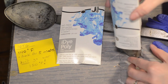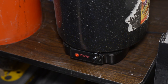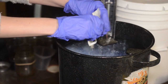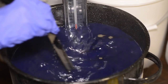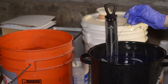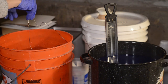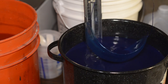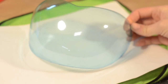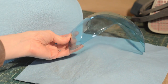You can dye PETG plastic with polyester fabric dyes — we have a more detailed video on this process linked below. A large pot of water is heated to 140 degrees, and I mixed in two packs of iDye Poly Turquoise. The visor is attached to a wire hanger and dunked into the pot for five minutes, then washed off in a bucket of cold water. This process can be repeated until the desired tint is reached. I needed a very light blue tint, so I only dunked the visor twice. Any remaining dye chunks can be buffed away with plastic polish. I think the visor turned out all right.